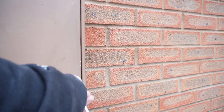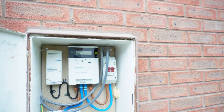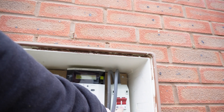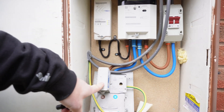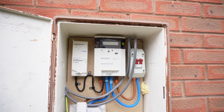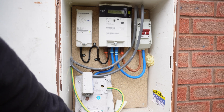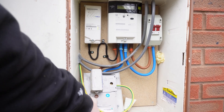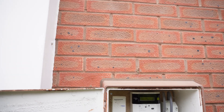So we're going to look in the main meter cupboard together. We've got a mains isolator, which is fantastic. It's a 100 amp type 2 - brilliant. So there has been talk at some stage about an EV charger, so that'd be fine. Making sure there are no issues before that. If we had a shared supply, there'd be another lead out of here. This is on the L1 phase, just in case. It's all nicely labelled up and it is a TN-CS system. So we're all good to go. Let's pop inside.